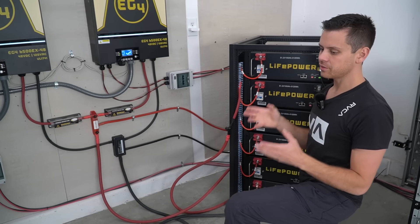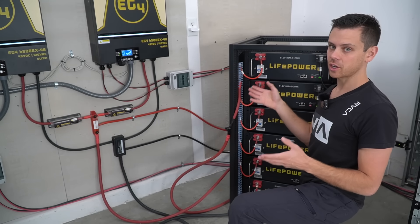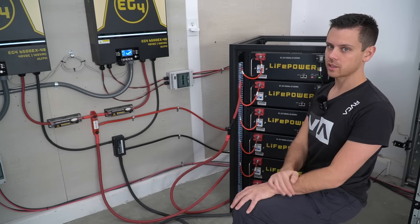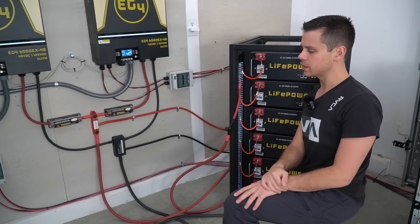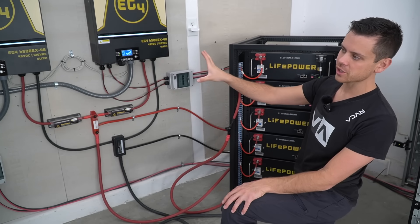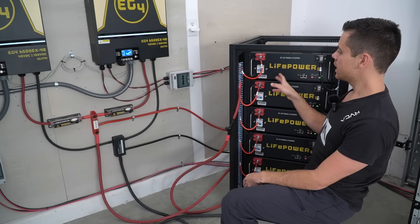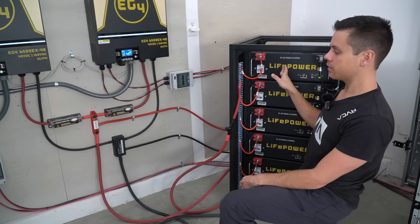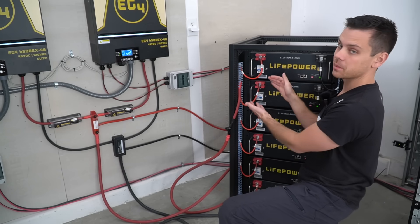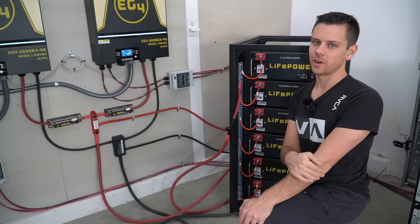In a future video we'll cover communication and how to set that up with these inverters and batteries. For this video, the crucial points are: make sure connections are tight, check the current on each battery, and ensure each battery is actually working before connecting the communication system. I'll also have a blueprint of this configuration for split-phase output on my website, and you can buy these batteries with the link below. These are the cheapest and most compact server rack batteries on the market. See you in the next video — thanks for watching!